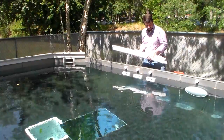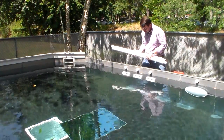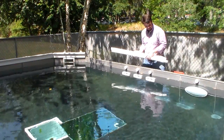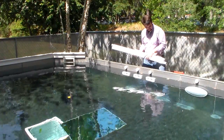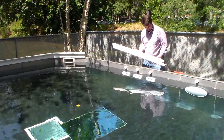In order to align the jets properly, you will need an alignment tool. Your builder or dealer can make this simply by using two 4-foot lengths of 1.5-inch pipe, two 1.5-inch slip-by-slip couplers, and two 1.5-inch tapered slip barb hose adapters.